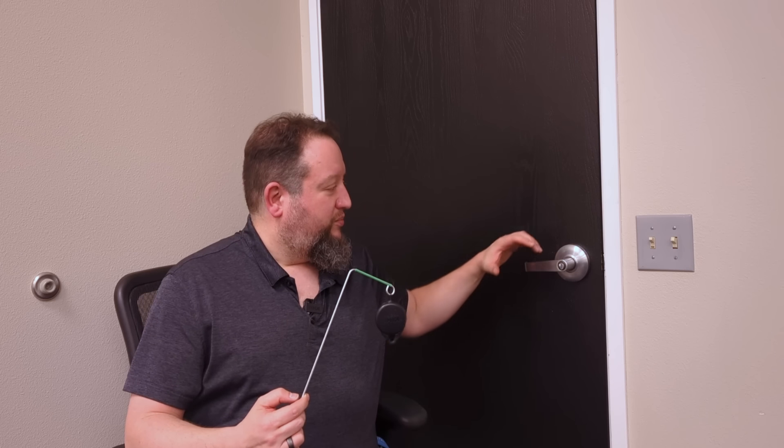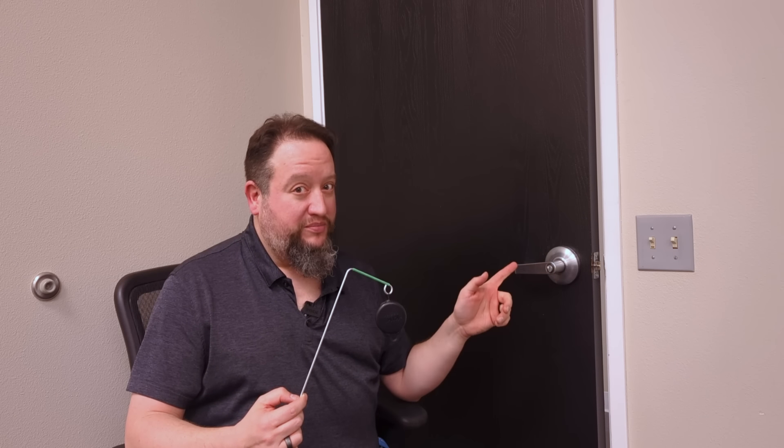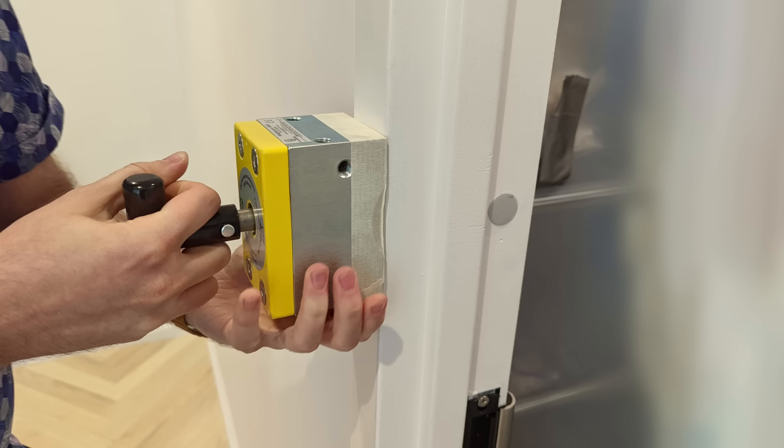We've got ourselves a pretty great underdoor tool now, ready to attack this and similar handles. But as a lot of you know, the problem with bypass entries isn't really getting a good grip and slipping the latch. The problem is as soon as that door starts to move — what if you have a door position sensor up there? What if you have monitoring going on in the access control system? How do you prevent throwing an alert if you've just used another door tool in a secured space? The best way, in our experience, is either get out your big mag switch and crank that down if you've identified where the door position sensor is, or trip the REX sensor on the egress side, letting the system be fooled into thinking someone is going out.